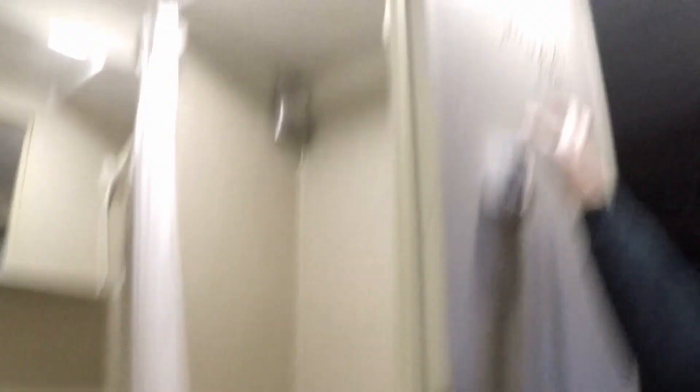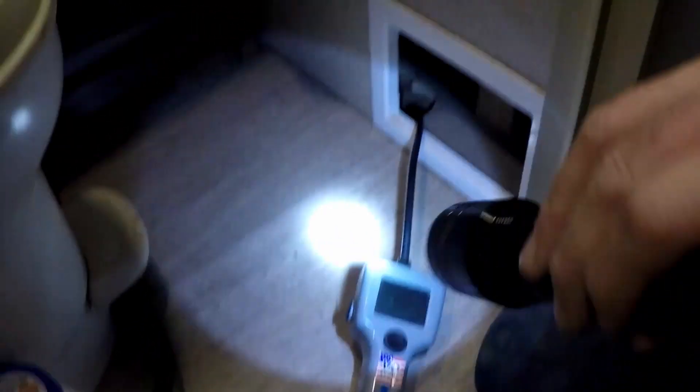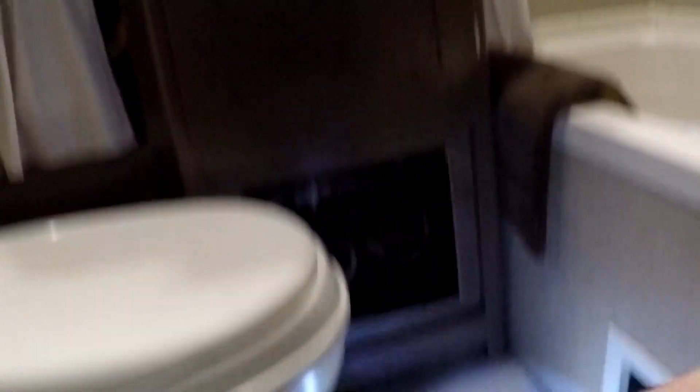They've already got some cutout in the wall where wires and tubing for the shower water come down, so I don't have to make any holes other than cutting some up here. There's a hole right there for the drain — I want to put the wires right there and route them the same direction as the bore scope, back over to the frame and then down, running along the inside of the frame to the front. That frame is about nine inches off these pipes, so it's not very far to run the wires, and I'm working with about 16 feet of length.